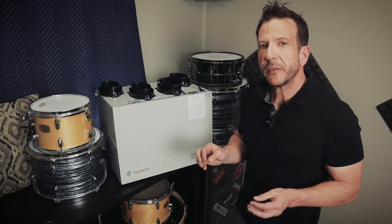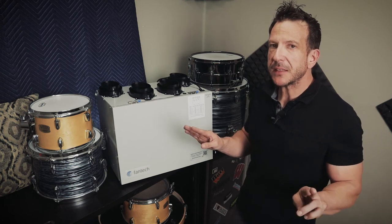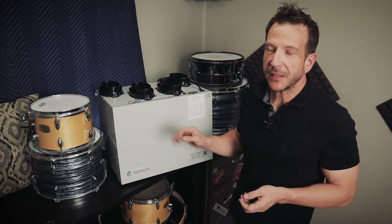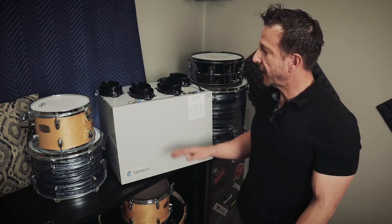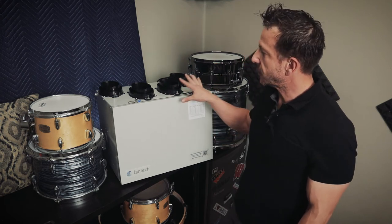So with this heat recovery ventilator, really what we're doing is we're separating the H and the AC from the V in terms of HVAC. In the industry, that's also called a dedicated outside air system, meaning it's managing ventilation on its own. And I think one of the advantages with that is that the air quantities are much smaller.